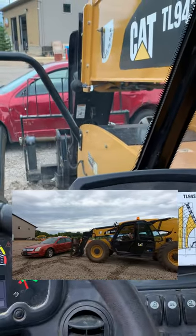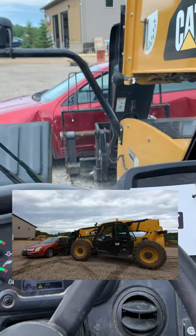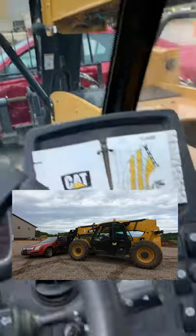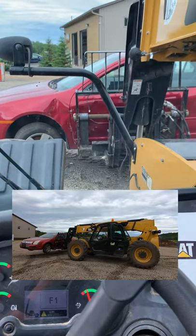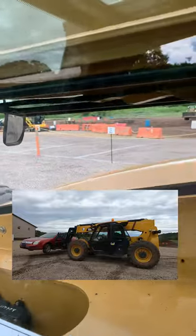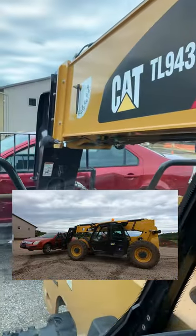So after you got that, I'm going to go down. Once I make contact, I pull back. Then I'm using my thumb to roll that up a little bit, and then just raising it up just a little bit. You want to stay low to the ground. This is a good travel position because I can see underneath the boom arm — I'm at about zero degrees right there.